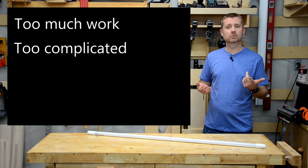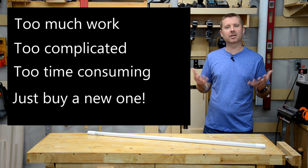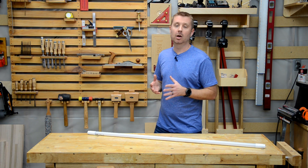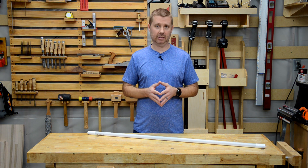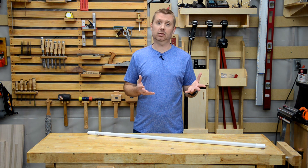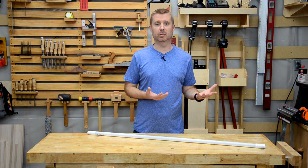Let's go over some of the criticisms of that first video: too much work, too complicated, too time-consuming, why not just buy a new fixture? I don't necessarily disagree with any of those criticisms, but I am a firm believer in bypassing the ballast when you convert to LED, and that's for two reasons. First, ballasts consume electricity — not a lot, but they do consume power. Second, ballasts will fail, and when they fail you'll have to rewire the fixture anyways, so knock it out right from the beginning.